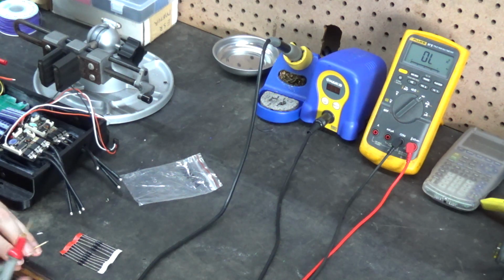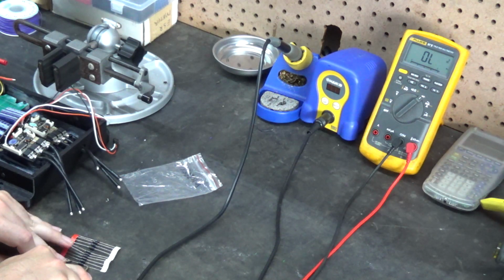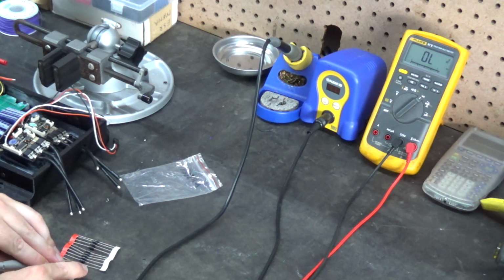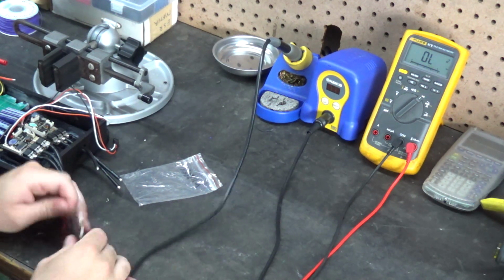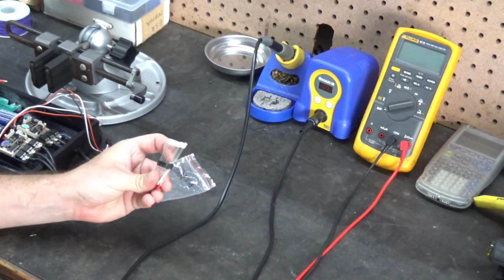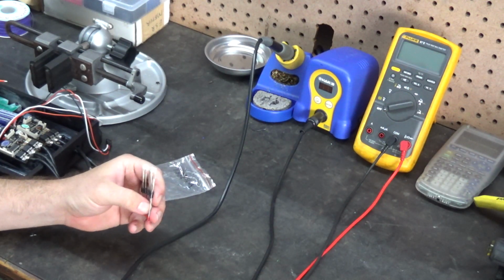So I have my meter on Diode Check. So that should be forward bias. Oh, you know what? I bet I can't check this because this is a 9-volt battery. Okay, I checked Google, and the reason they're not marked is because they're bi-directional diodes. So I don't know if I messed up there or not.